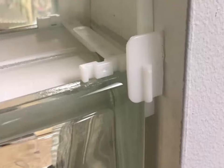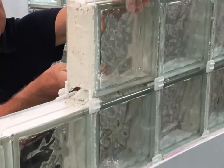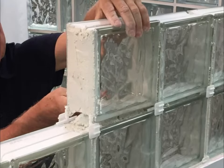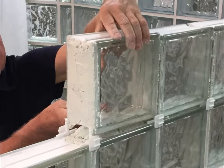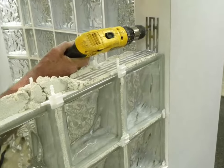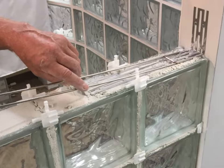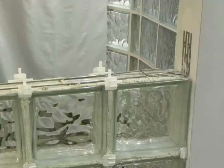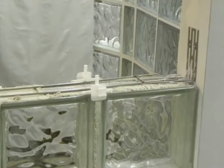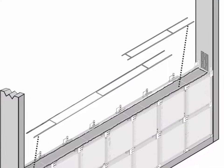To ensure alignment, place a T spacer against the jam at the upper corner of this block. Continue installing each block as you did with the first row. Temporarily remove the previously installed T spacer at the jam and apply an approximate one half inch mortar bed on top of this row. Next, install the panel anchors at both jams using two screws per anchor. Lightly press panel reinforcing into the mortar bed along the entire length of the panel so that it is completely embedded in the mortar. Panel reinforcing is always installed in the same horizontal joints as the panel anchors. Make sure the panel anchors and panel reinforcing overlap each other. If more than one section of panel reinforcing is needed in a joint, overlap them by about six inches.